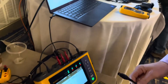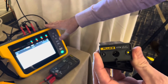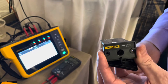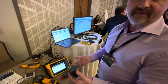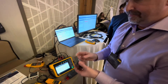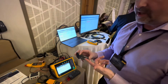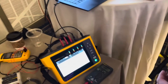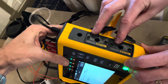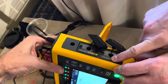I've done a video on this before but haven't had one of these to show. This is the new cell card adapter. For the 1770 series platform, one of the typical customer requests is to be able to remotely gain access to data and control the product from a distance. A lot of times a local company doesn't have ownership of the IT infrastructure, or it's out somewhere with no wireless infrastructure. So we've added a cellular LTE 4G card module — you simply insert your SIM card from your provider, which requires a data plan and a static IP address from your provider, and it inserts into the side of the meter. One slot comes with the Wi-Fi and Bluetooth module already in, and then the LTE module goes into the other slot down here, along with a GPS antenna.